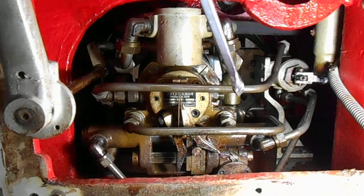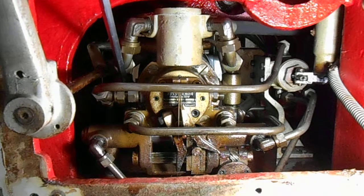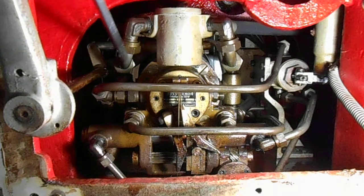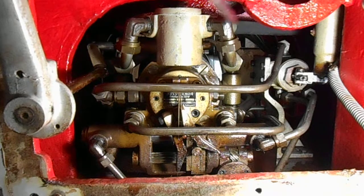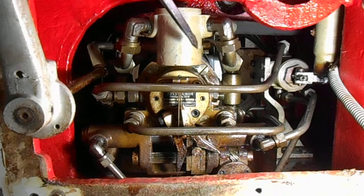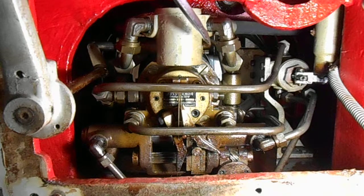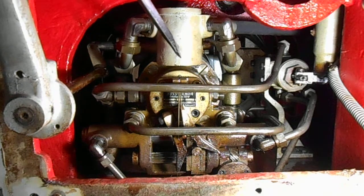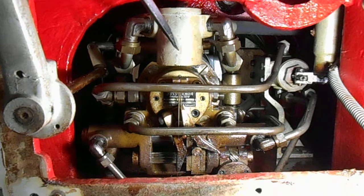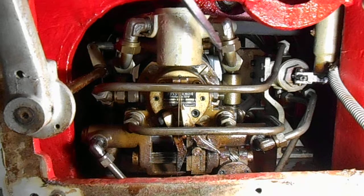That's one half of the system. The other half — there are two pick-ups, left and right, down here and down here. These feed the main part of the pump. They've got one-way valves down at the pick-up end with overload valves as well. With them set as they were, they shouldn't be leaking anything. I believe they're just there in case the table gets stopped or hits the end of its travel, and they'll also let air out. But I don't believe they should open normally during use.